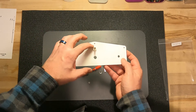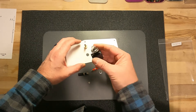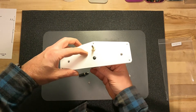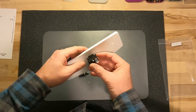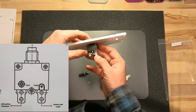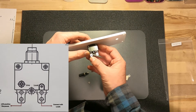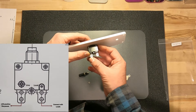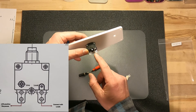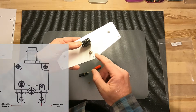The middle one is the only one that has to be specific to the white post, because your resettable breaker is going to go in right there in the middle hole. When you install this, you have two terminals — a line and a load. The line is going to run from your power supply to the line terminal, and from the load terminal you run right down to the controller.